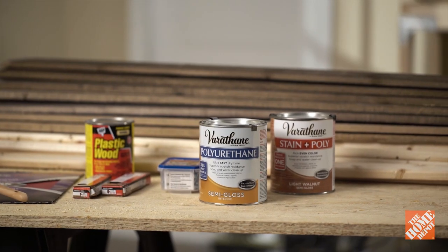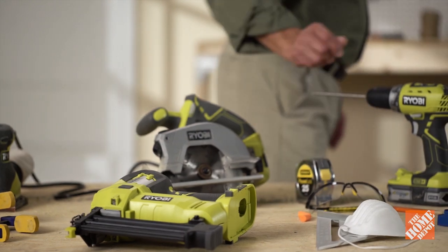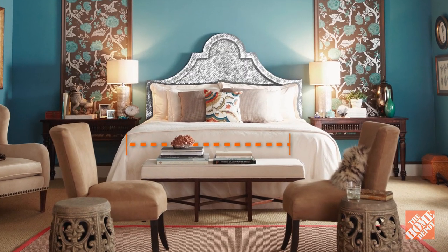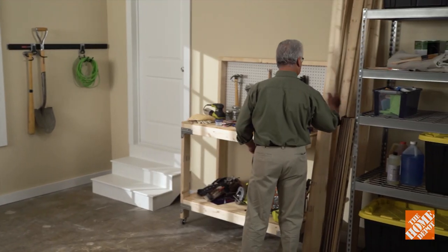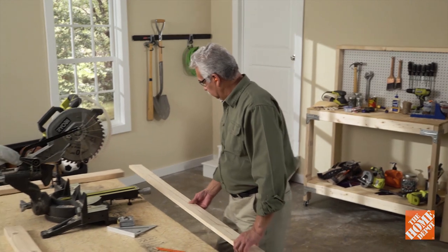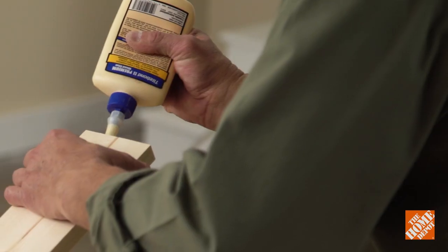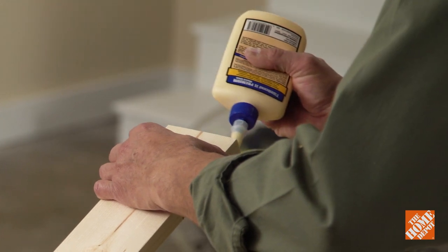You'll need wood screws, bed rail handles, and other tools and materials that'll be covered a little later. Be sure to measure the bed frame to determine the size needed for the headboard. Once your measurements have been taken, gather the necessary amount of lumber to complete the project. Use wood glue for additional bonding support when connecting the lumber pieces together.